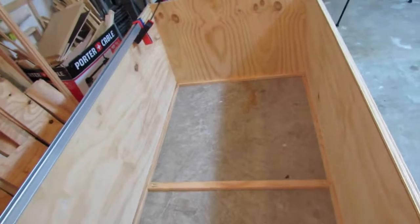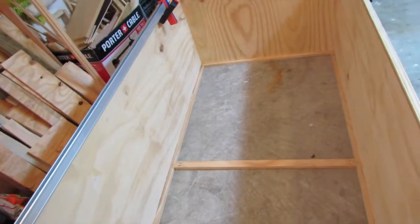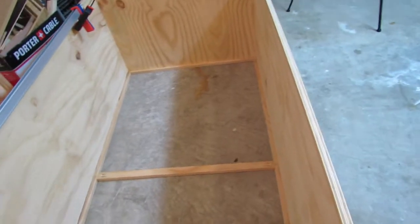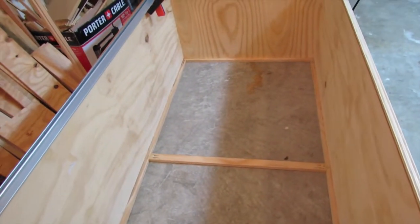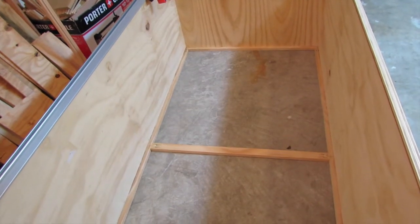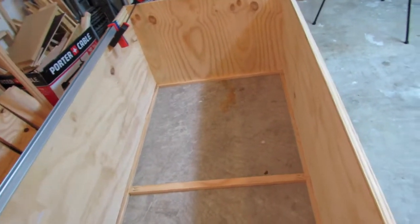On the front, of course, will be doors. I haven't decided yet if I'm going to go with four small doors or two large ones. I'll make that decision later after I have the shelves in. So the next thing to do is to cut my shelves the length, put them in and get them all mounted and glued and screwed in. That'll be the next video.